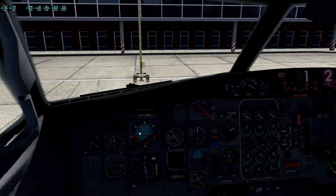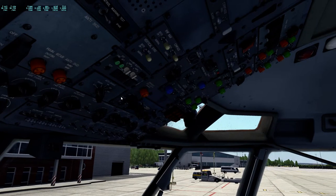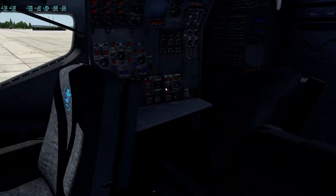Now we do our cockpit safety inspection. Make sure that our flight control switch guards are closed. Alternate flaps are off, so the guard is closed and both switches are in the off position. Make sure gear is down. Our transponder here is off. Our hydraulic B pumps are off. Our ground interconnect is closed.